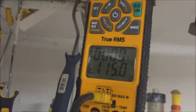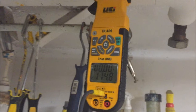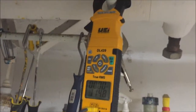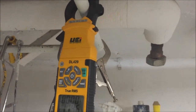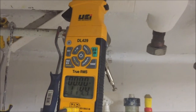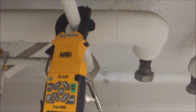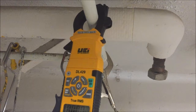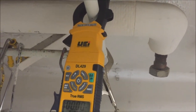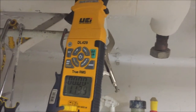With the leads in here you can get your amp draw — your top one is your amp reading and your bottom one is voltage. You don't have to take the leads out or do anything weird; you get the measurement right away without cycling through buttons. You clip it on there and get your amp draw, get your voltage, do your calculation for your capacitors. You've got the thermocouples you can put on top of your lines to get your temperature — but obviously, like I said, when you're using copper or any metal type of line I would suggest putting a piece of Teflon on there if you're going to put two on at one time. Air temperatures are not a problem — it'll do air temps with no issues since they're not touching anything metal. But that's a quick overview of a problem I was having with the DL-429 and the positive things about it. I haven't used the Fieldpiece clamps with it. The manometer accessory worked out okay, but if you don't have a lot of the Fieldpiece heads that's probably not a selling feature. That is an overview of the DL-429 — the good and the bad. Thanks for watching.